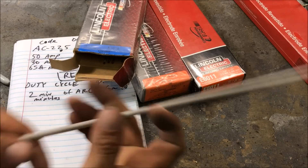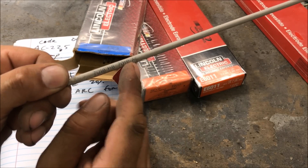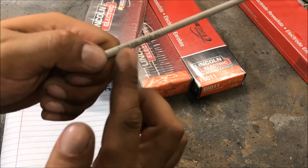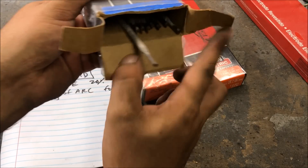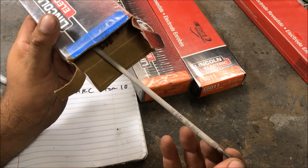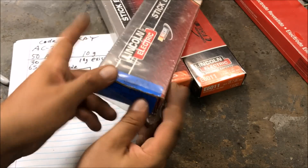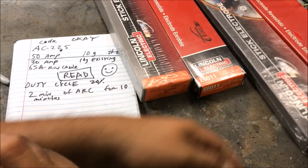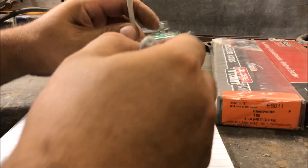When you first start, you're just welding mild steel — regular carbon steel. There are AC and DC rods; it's a 7018. AC rods — familiarize yourself with this kind of stuff. If the rod doesn't have any numbers on it, be careful — these 7018s have been open and left out, which pretty much ruins the rod. Keep them closed and inside away from moisture.